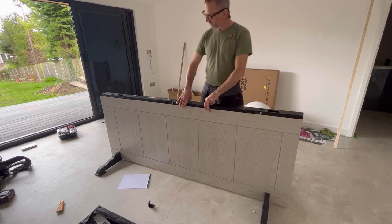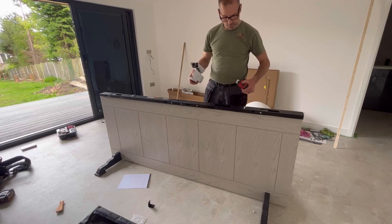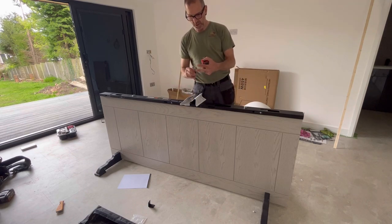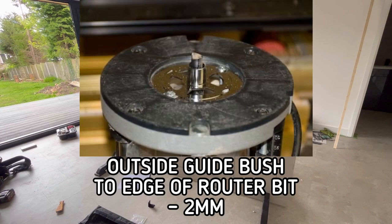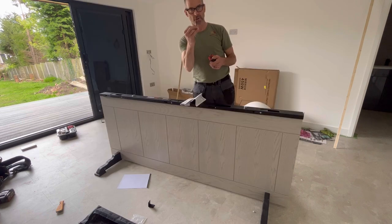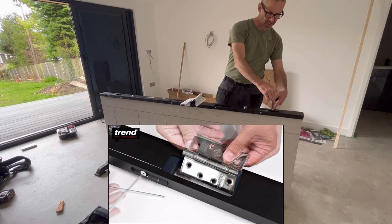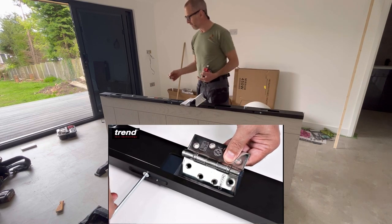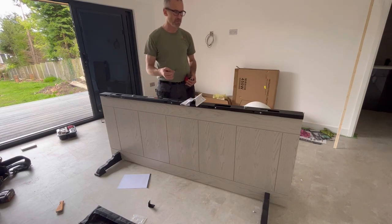Check your sizes — mine should still be set at 6 inches and 9 inches. Put in your packer, which is this little 2mm packer. Half of that is the thickness of your collet in your router, so the double thickness allows for when you're routing — it allows you to route the correct size out. Just put that in there, put your hinge against it, and tighten these down. I'm going to put two hinges on this because these are ball bearing hinges and they're good hinges, so I'm happy with that.